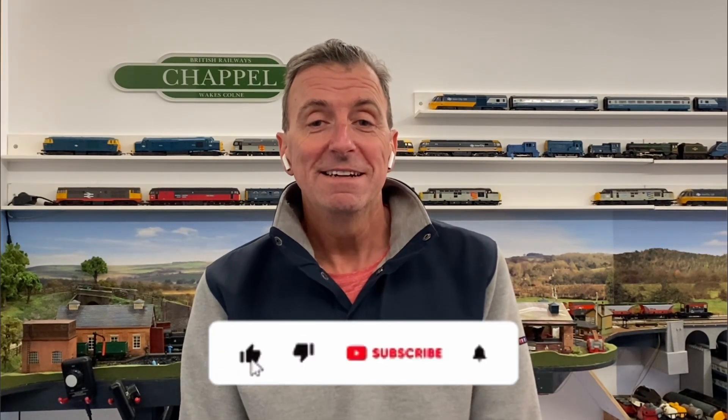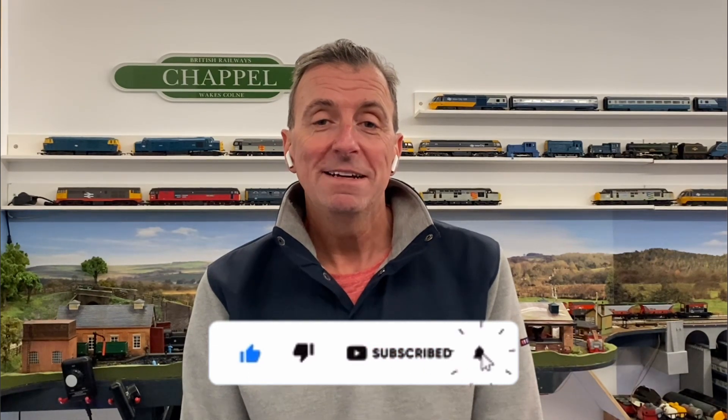I'm doing this without soldering because I really hate soldering and I'm not very good at it. I do want to go fully DCC so I need to improve the feeds to my layout. It is running okay even with a single feed, so if you're not into putting a bus bar in but want DCC you can do it - my track does work - but some of the DCC locos do stutter in a few areas, so I'm going to add a few extra feeds without soldering. Don't forget to press the subscribe icon down below and let's get into doing some wiring.